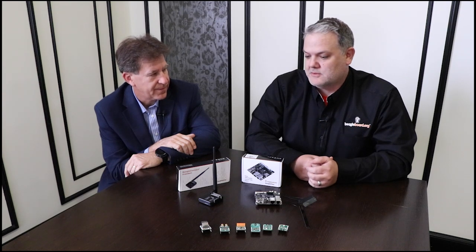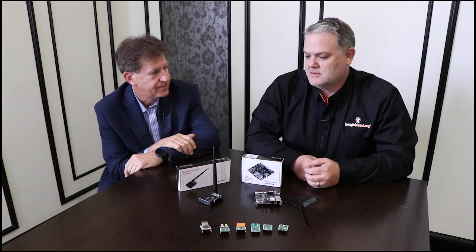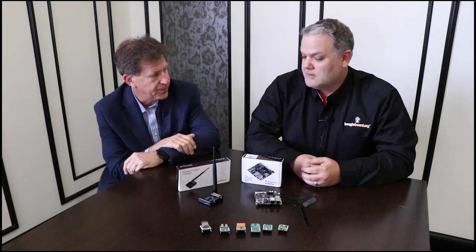A kilometer away — what's your wireless medium? We're using 802.15.4G, but the radios are actually very flexible. They can run things like Amazon Sidewalk and Wi-SUN. There are a number of different protocols for closer range as well. We're using the TI CC1352, which is a software-defined radio — it does sub-gigahertz frequencies as well as 2.4 gigahertz, so we get a lot of range out of the communications.